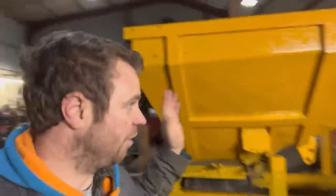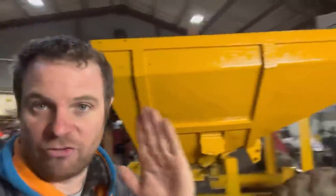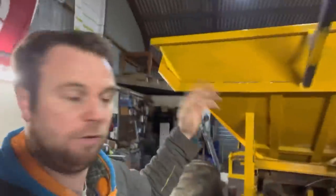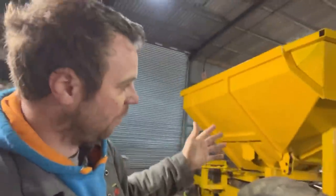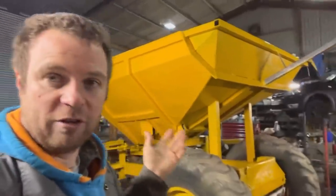I suddenly realized I bought this stone trailer in the summer, and last winter we were doing draining — people knew what a stone trailer was, but lots of new subscribers don't. Basically, when you dig drains you dig a trench in the field with a big chainsaw-type thing on the back of the tractor, and then you put stone above the drain so the water finds its way down easier. The idea of this is it's a big hopper — you fill it full of stones and drive along the field with the belt going, and it dispenses the stones into the trench. You could do a few hundred meters with one hopper full. With a trenching machine and a roll of 100-meter pipes, you'd have really long trenches to fill — if you went with a bucket you'd have to keep tipping and moving, which is really slow. With this you just fill it, drive along nice and steady, and let it meter it all out. We did look at getting a bigger one or making one to fill the seed drill, but that's totally impractical.